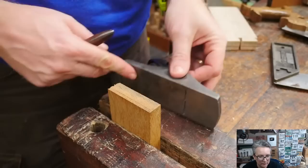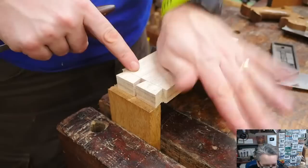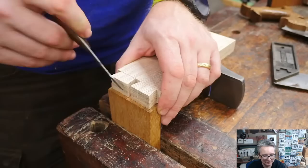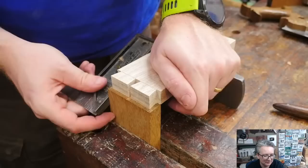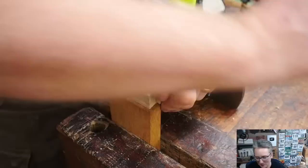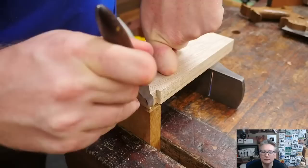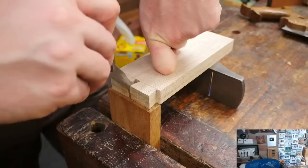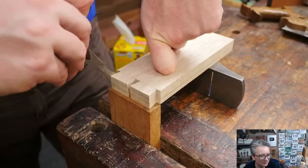What I've got here: I'm going to have the pin board in here set up to the same height as my block plane. That allows me to put the tails board on here and know that it is level and at 90 degrees to the surface. I'm going to put my knife into the line we drew earlier, put this right up on there, then flip my square over and use the bridge of it to make sure the board is tight up against that side. Then very carefully I'm going to mark light, medium, hard. Of all the things in the dovetail, this is the most important step — if you can get an exact line transfer here, you can get a good joint. If you can't, you won't.